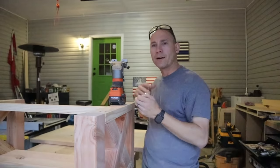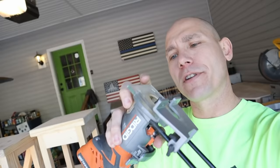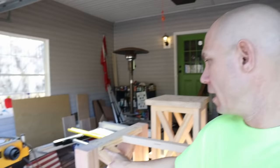Now I've got to get ready for the tabletop before I paint it. These are Rockler tabletop fasteners — you can get them at rockler.com for about $3. I'm using an eighth-inch straight bit to cut slots. Some people use a biscuit joiner for this — any way you can cut a slot in your material will help. I've cut slots here for my tabletop fasteners to attach to. That's how we're going to attach the top.